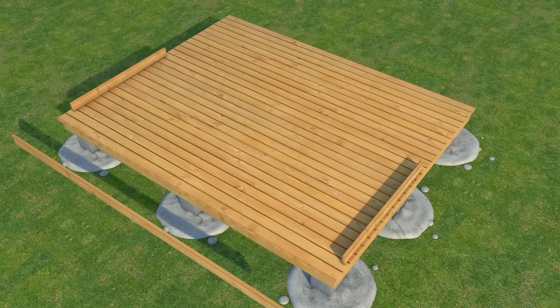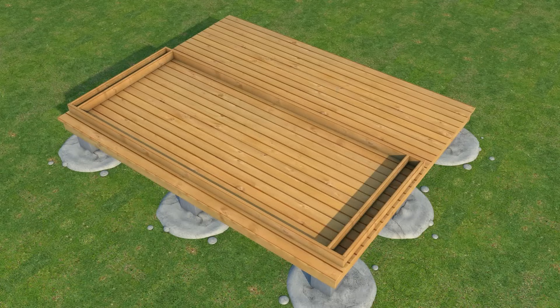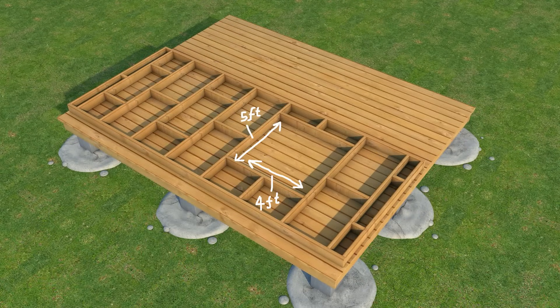I placed two timber plates that are 16 feet long and joined them with studs that are 6.5 feet long. I left 2 feet between the studs. The size of the window was 4 feet by 5 feet because I wanted more light inside the cabin.